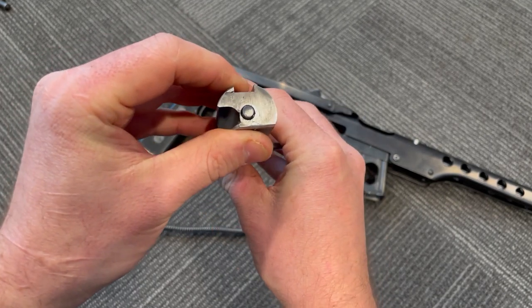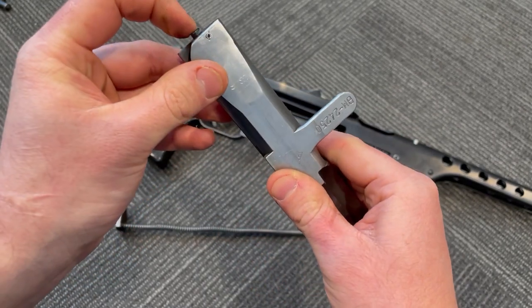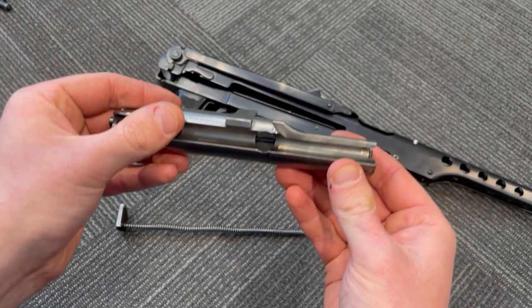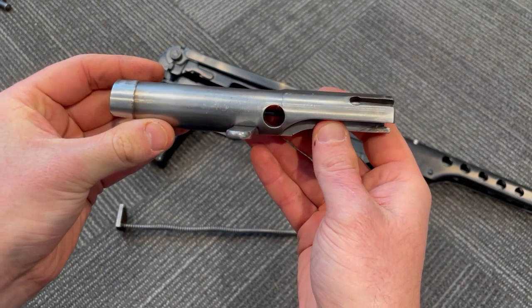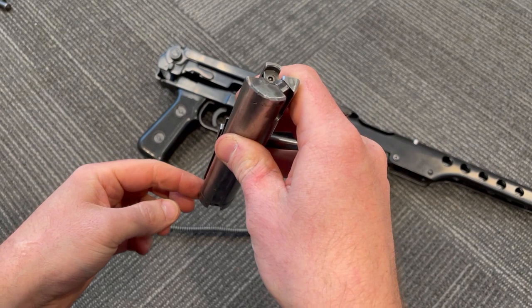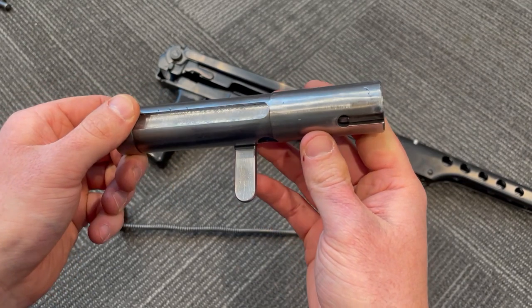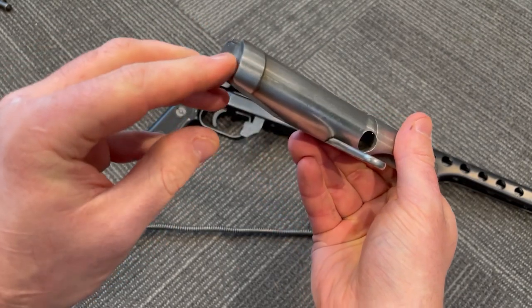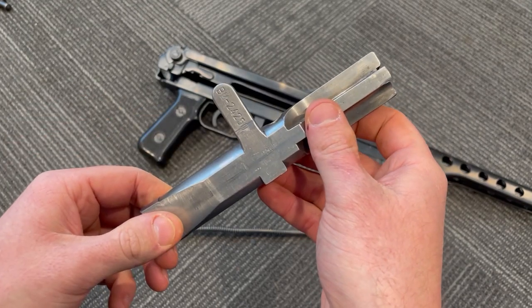Mine is really rough — I made this with a drill press. Now I make them on a mill; I bought a milling machine just to make these. There's the striker rod in the back, spring loaded, going through the bolt. It's real difficult to make these well and repeatably because of the long drill all the way through — if you don't indicate it on a mill very well, or don't get it chucked in your lathe 100% correctly, you're going to drill through sideways and come out the sidewall. But I've pretty much mastered a way to do it repeatedly without any issues.